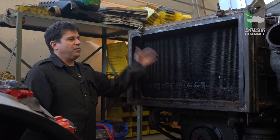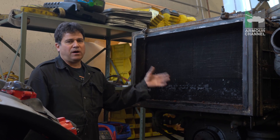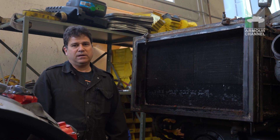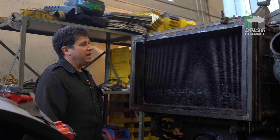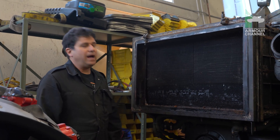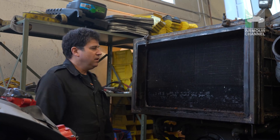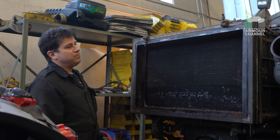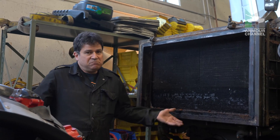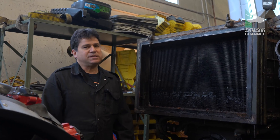As I mentioned, replacing the power pack with a good Leopard crew and a good ARV crew takes between 25 and 30 minutes. It's an easy job and it allows you to do all the maintenance on the engine itself outside the tank. So if you have to change the oil, change the coolant, or fix something on the engine or transmission, access is easy once it's out of the tank — because if it's in the tank, it's another story. Thank you.